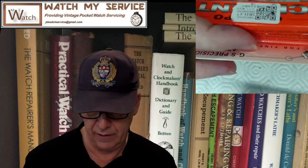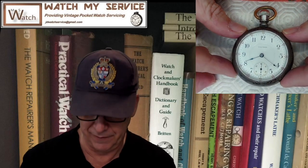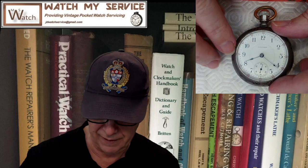This stuff is excellent and it doesn't set right away. So what you do is you apply it and then you wait a couple of centons. That's Klingon time maybe. You wait a few minutes, and then you put that down, right? So when I fixed the crystal on this watch that is still running, I went all around the edge, and what you do is you hold the applicator steady as you move the watch around, okay?